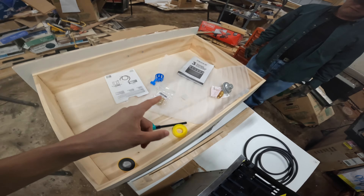We were also waiting on parts for our range stove because I want to get this installed next. I bought this elbow but it turned out to be the incorrect fitting because it was not flared. So I got this extension piece and then this nipple from flared to NPT or pipe fitting. That's going to go there, and this is a pressure regulator that's going to go on the end and then connect to our propane tank.